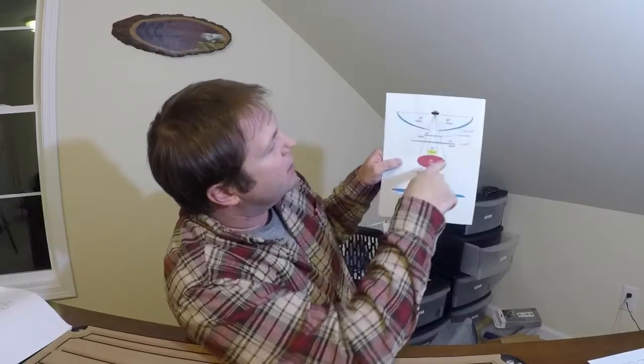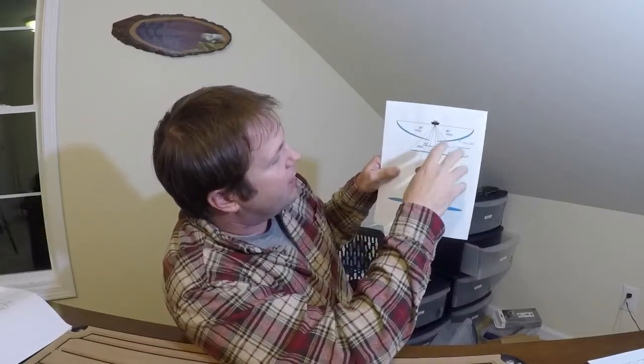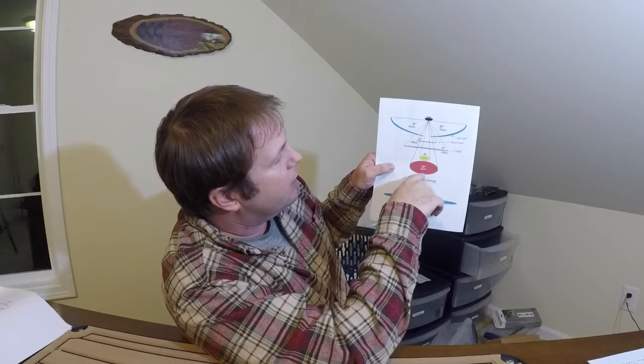As you can see, you think of it as a cone. The 83 kilohertz has got you a 60-degree cone — it's going to give you a wider area. Then the 200 kilohertz is going to be a more confined cone. Because 83 is such a low bandwidth, it's going to penetrate deeper into the water column. Your 200 kilohertz is a smaller cone, and it'll allow you to kind of dial in on a spot.